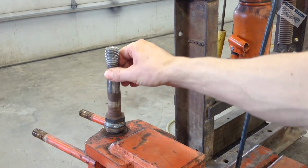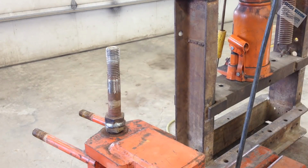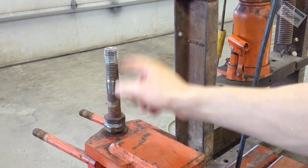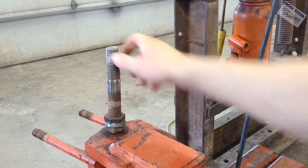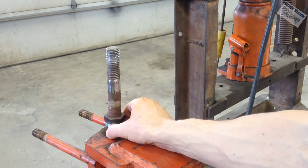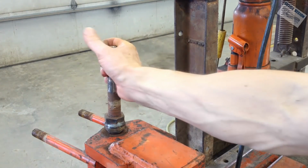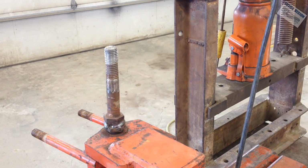Well, it's not always a success. That bolt is stretching out too. Pretty good concave going on there. So quitting, I'm going to drill this thing out. If you notice though, the head of this bolt is up off quite a bit. I think it's stretching out too. I was hoping it would actually stretch out and break, but this one's going to break first. Oh well, this one's going to be a drill it out.